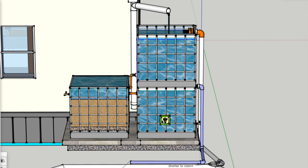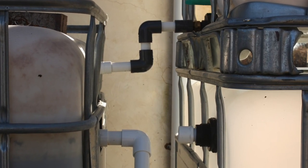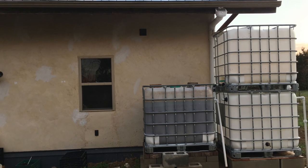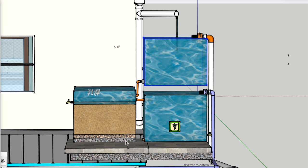I've got a spigot here positioned high enough to fill a two-gallon glass jar of clean water. You can connect these tanks to create a collection, filtration, and storage system very easily. Quick rundown of the big picture: rainwater comes off the roof, falls into the surge tank which holds 300 gallons, then slowly gravity-drains into the biological sand filter. This whole tote is dedicated to filtration. There are several different layers — coarse gravel on the bottom protects the finer gravel from getting into the piping system at the bottom, which collects filtered water and sends it up and out into the storage tank.